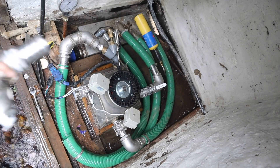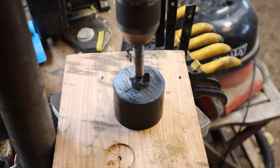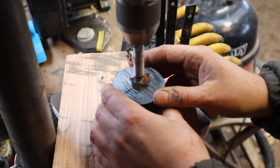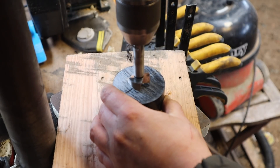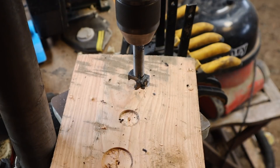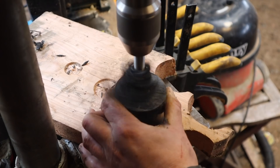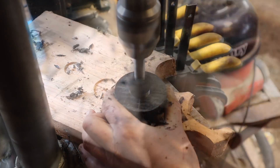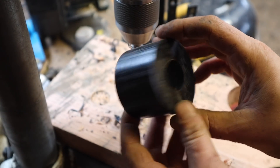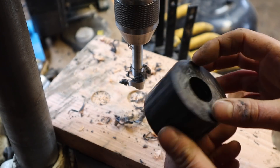Let's do this fairly quick - I want to get this back working and see if it actually makes any difference. First thing I'm going to do is drill a hole down the middle with a forstner bit. There's our hole, sort of through the middle. Now we'll turn it down and make it all nice and round and add a taper to it.